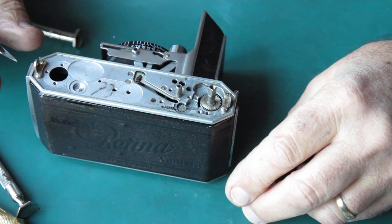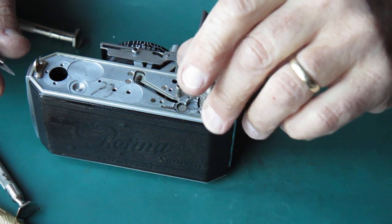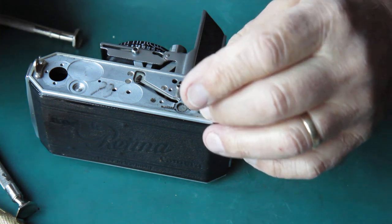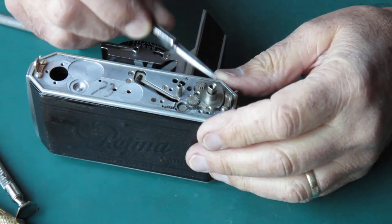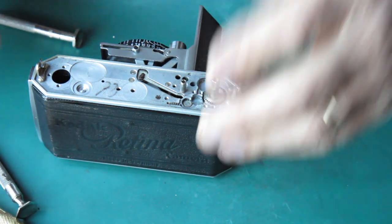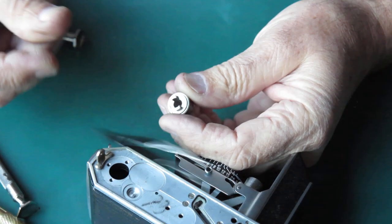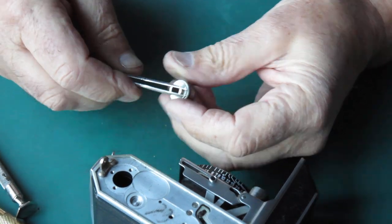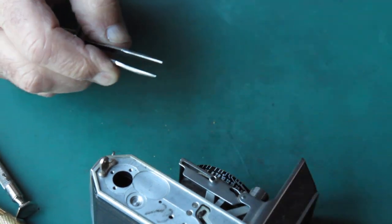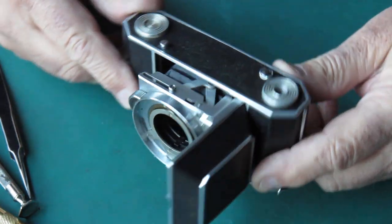I'm sorry, the camera had stopped recording — I don't know at what stage we lost that. I think I got to the end of the file size limit, sorry about that. Just taking out the three screws that held the top bush for the film advance, and here's the clutch. Take that apart — that's the top of the camera dealt to. Now the bottom of the camera.